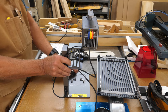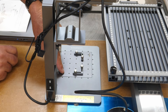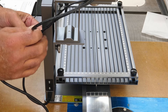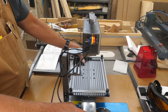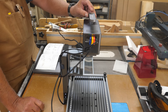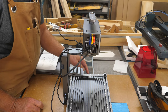Repositioning the clamp brackets: count the hole on the outside of the base — that's one — then go two more holes on the inner plate, and the third hole is where you set your bracket so it fits up flush. Getting the cord out of the way; I need to get power back to this. The next step per the instructions is to push the slide all the way to the back, then turn on the laser pointer and the red dots need to fall right on the edge of the surface.